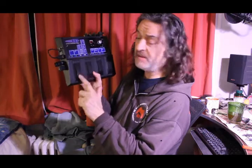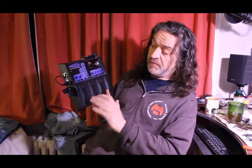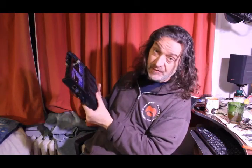I've jimmied the board so I can get access to the buttons on these four pedals, because you need a guitar processor you can stomp on. I hijacked from the old board the four buttons, two LEDs here, and another LED back there. I haven't yet wired those to the GPIO pins of the Raspberry Pi, but at some point I'll do that so I can control the features of my guitar processor with these buttons.